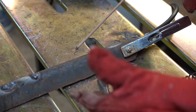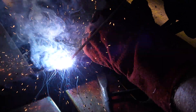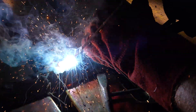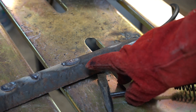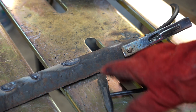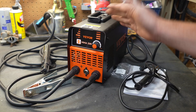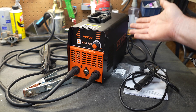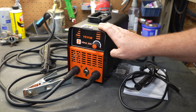The current is now set to 85, the hot start is set to 60. With those adjusted settings, there was no sticking at all — the hot start took care of that. I think with a little bit of practice, we could do okay with that. It could be turned down a little bit, but the machine actually welds really nicely.